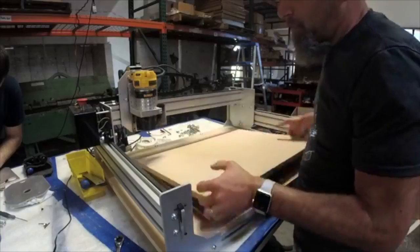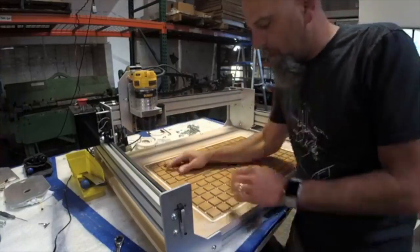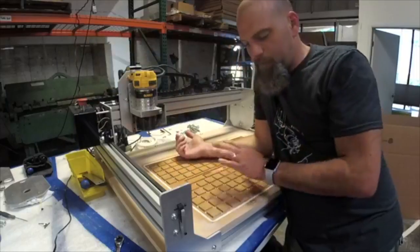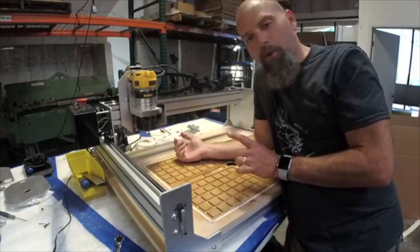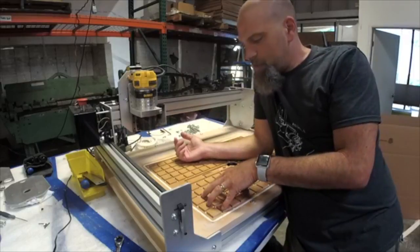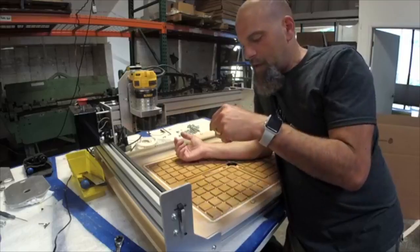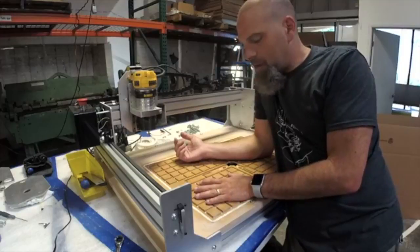But for whatever reason, it's not pulling through the MDF. One thing we tried — we read on some forums that if you coat the inside, we used a sealer to actually coat all of the inside of this. Maybe we need to do more sprays — we did about two coats. Maybe we can get the performance out of this so that it does pull enough air through the top MDF to truly have a waste board that's expendable and will hold down the material. Anyway, that's the vacuum table attachment.